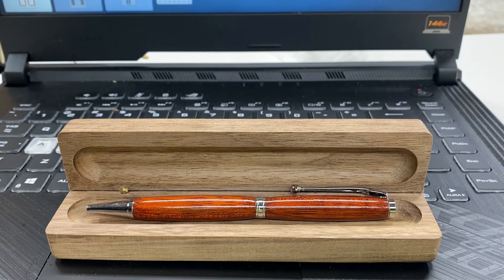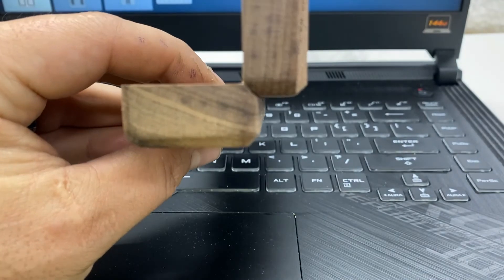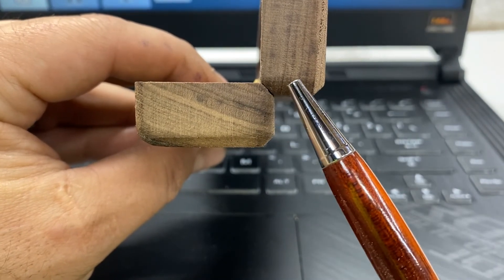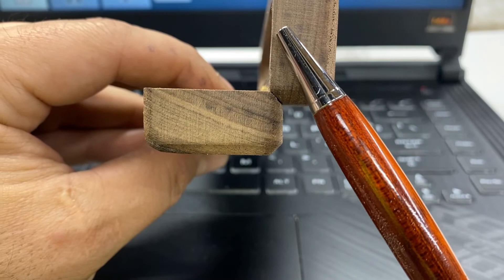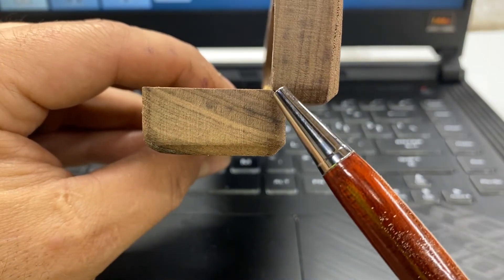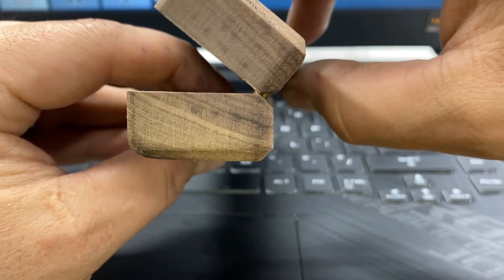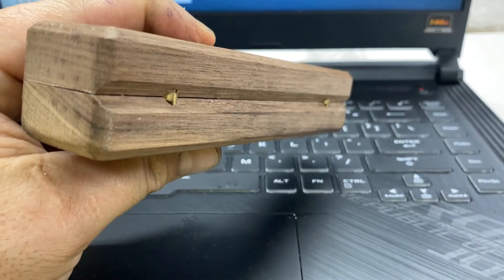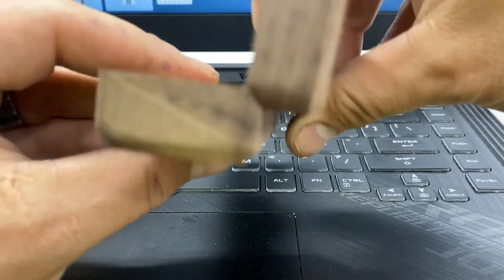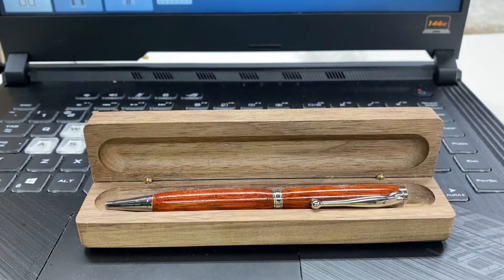As you can see, this thing stays open perfectly without any assistance. We have our 45-degree chamfer on the base and 45-degree chamfer on the lid, which creates a perfect 90 degrees right there — this thing stays open. If you watch that point right there, that's our pivot point, the center of our barrel hinge, which works the same as the center of any hinge. We close the box — nice look from the back, from the side profile. Box opens up, stays open. Put our pencil, put our pen in there — perfect.